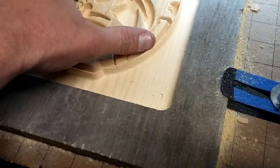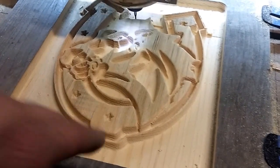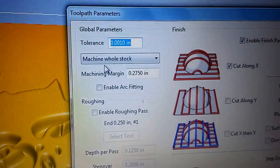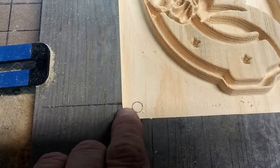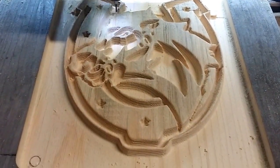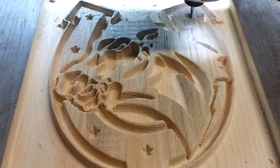By the way, I'm actually cutting deeper than the bit is allowed — the bit only has about a quarter inch of cutting material, yet I'm 0.38 inches below. What you do is cut full stock with the quarter inch bit first, and then come back with the small bit. That small bit will never hit the side and bang into wood that hasn't been cut, allowing you to cut deeper with a short bit.